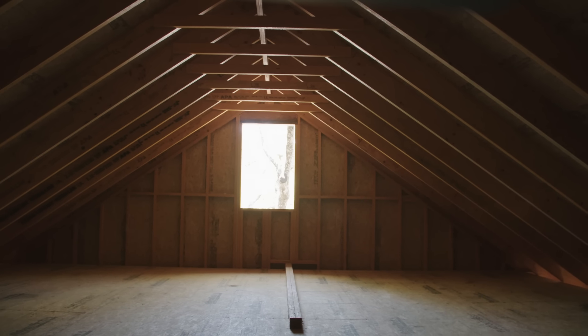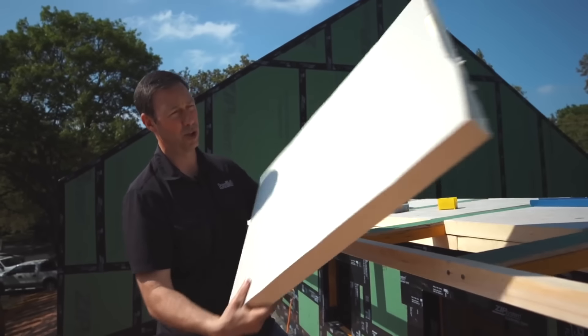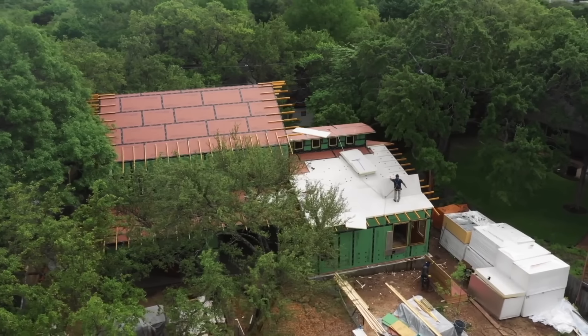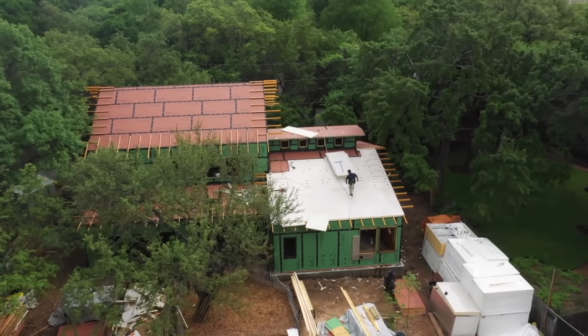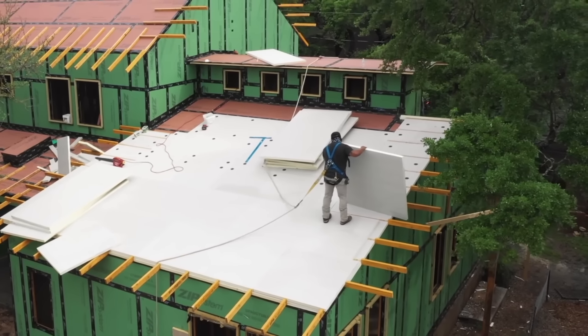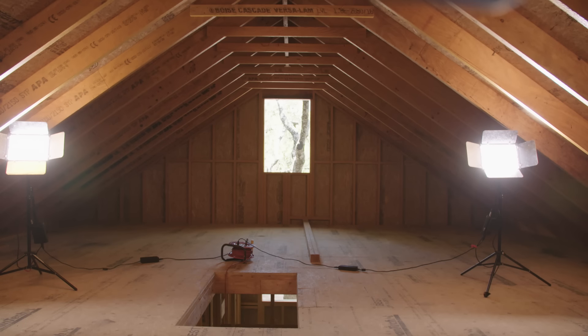One last thing on this attic: if you haven't seen my other videos, this is a fully insulated roof deck - we basically made a SIPs panel out of the roof system. It's a non-vented attic with no vents at the ridge or rafter tails. The house is fully insulated with exterior insulation from Atlas polyiso. In the attic I'll come back and use rock wool batts in the rafters, and that entire attic space becomes part of my air-conditioned envelope - fully air-sealed on the outside, insulated at the roof deck. That's some great storage space.